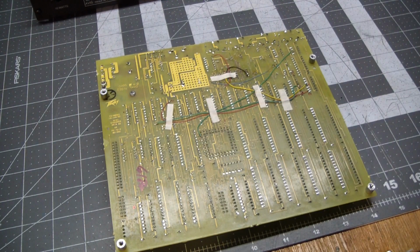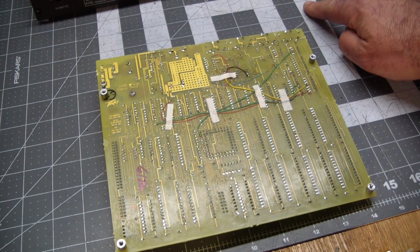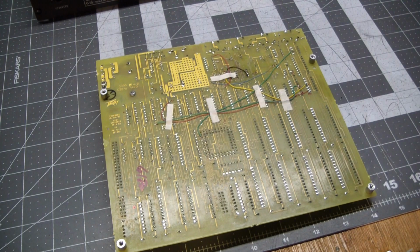So I made the connection, and it seems as if I saw some life out of it, but let's put it back together and actually get a device that makes a Midi sysex dump, i.e. it dumps some data, see if this can receive it, save it to disk, and then we can reverse the whole thing, i.e. load in the file we just received and saved, and see if we can send it back to the device that originally sent it,